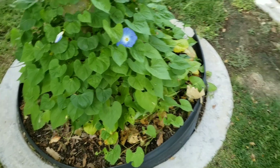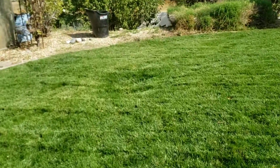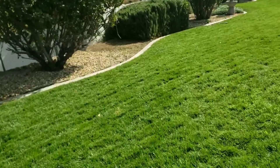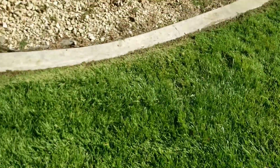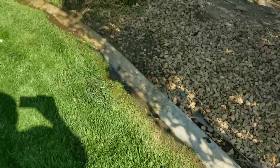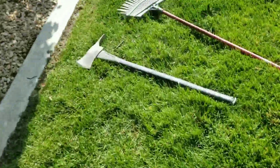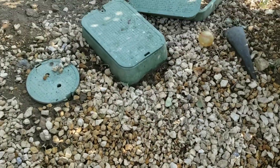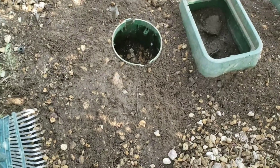For those of you that follow us, you know we've been at this house plenty of times. Last time I told you the morning glories were about to flower again in the fall. We're out here now because there's mushiness in the grass, meaning one of the valves we had looked at before — where the gophers took over — doesn't close anymore; it's seeping water and making the whole lawn wet. We have to come open it and probably replace one of them. We've already replaced three out of five valves. The boxes are completely full of dirt thanks to the gophers — we had left them open and now you can't even see them.